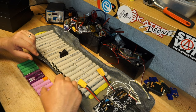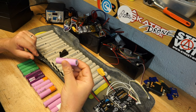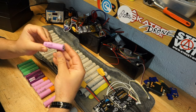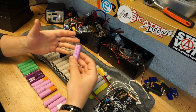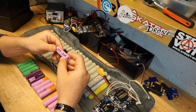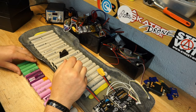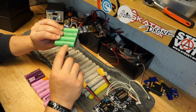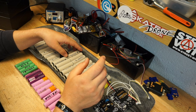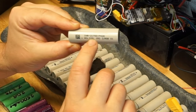One of them is the actual capacity of the cell. That means how much power it can store. The higher the capacity, the more range you will get on your board. And this is normally written in the description of the batteries. You will not find it on the actual battery. So you need to read up on the manufacturer's website, on resellers' websites, to see what the code actually means.